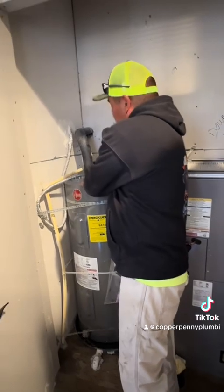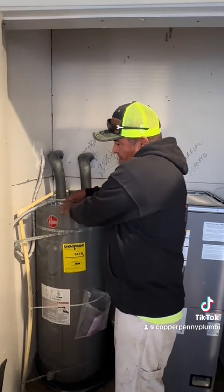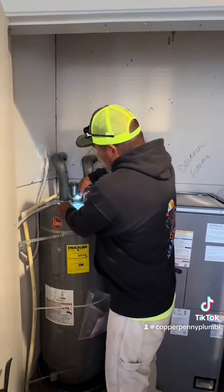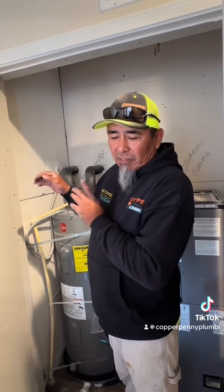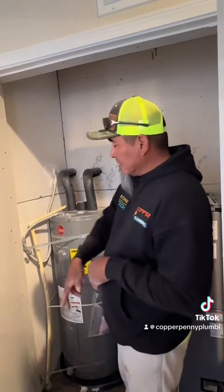But there's also low pressure. It's brand new, so the fixtures are new — unless they didn't bleed the line. All the fixtures could be clogged, because usually when you put in new lines, debris gets in there. Like when NTUA or whoever runs the line, they get dirt and debris in there while working. When you turn on the water, all that dirt in the line gets pushed through to your fixtures — even through to the cold side. Your fixture is done. This is one of the things other contractors don't think about.